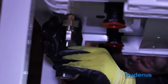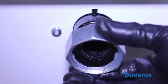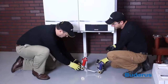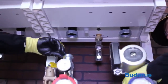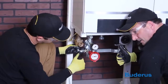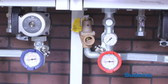Connect the gas valve provided by using the brass nut and gasket provided. Locate the supply and return water connections at the bottom of the boiler. Remove the plastic protectors. Connect the two union nuts to the supply and return connections. These nuts can be found in the styrofoam packaging at the top of the boiler. Next, install the pump groups by using the union nuts and the flat gaskets provided. This job can be done by one person but is significantly easier with two. Next, tighten the union nuts. The boiler pump group is equipped with a pressure relief valve. The relief valve should be piped to a suitable open drain or according to local codes.